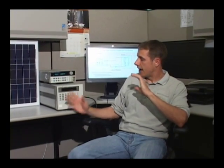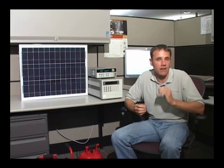One great advantage to using a DC electronic load to test photovoltaic devices is its power handling capability. Right here I have the Agilent N3301A, and in this half-rack 3U size I can sink up to 600 watts of power and a maximum of 120 amps in that small space — and that 600 watts comes in between 4 and 5k dollars.